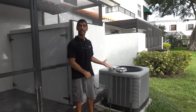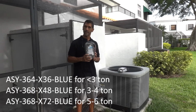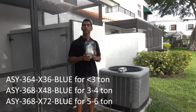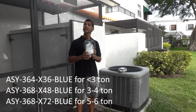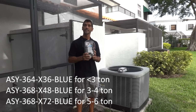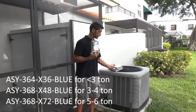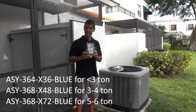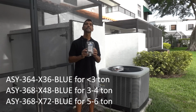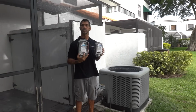This time we're going to be installing it on a 3-ton home unit here, and we will be using the EasyStart 368 model, specifically the ASY-368-X48-Blue. This model works for 3-ton through 4-ton home units. If you have a 5 or 6-ton home unit, you would use the ASY-368-X72-Blue. And if you have a unit that is smaller than 3 tons, like for our friends who have already installed EasyStarts on their RV units, you would use the ASY-364-X36-Blue.